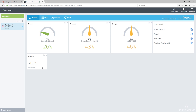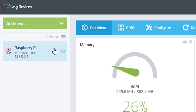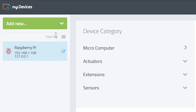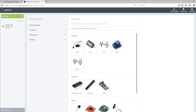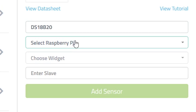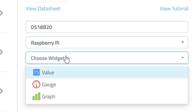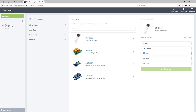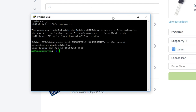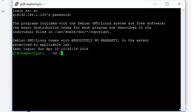To add it manually, simply do the following. Go to Add New in the upper left corner of the dashboard. Select device from the drop-down box. Find the device — in this case it is the DS18B20 temperature sensor — and add all the details for this device. In this case, you will need the slave address for the sensor. To get the slave address, enter the following into the Pi's terminal: cd /sys/bus/w1/devices, and then ls.